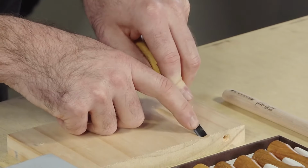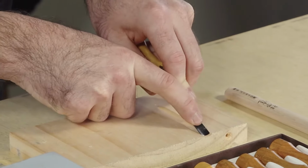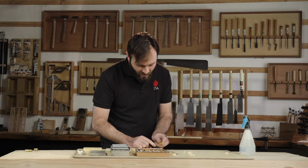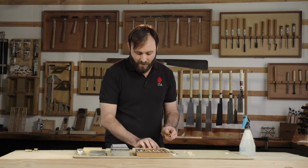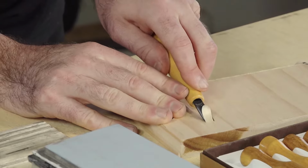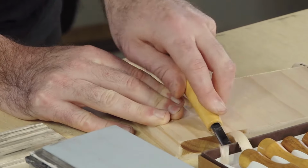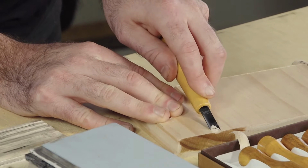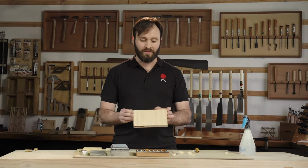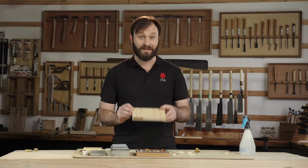When I put this in the profile, as I drag it back, most of that profile is in contact with my tool. So if I was setting something up and wanted to sharpen a heap of tools at once especially, I'd make sure I've got enough run on that I can really get in there. There we go. So then to this profile we add our abrasive, and what abrasive you apply is probably less important, just the fact that it'll cut.